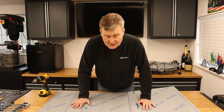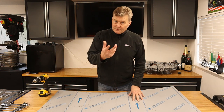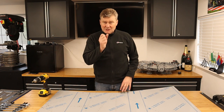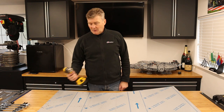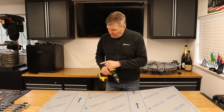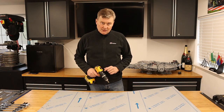Okay, back over to the assembly zone. I've taken the alloy panel off. Now, the very fact I've been drilling through this aluminium, which is quite a soft material, into hard steel, what's happened to the back of the holes, on some of them, there is a very slight burr. Now, what I'm gonna do is use my deburring tool, which I must say has earned its weight in gold so far, and just go along in these holes and just skim off anything that might, for any reason, lift that aluminium off the steel when it's riveted.